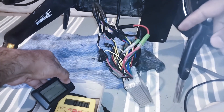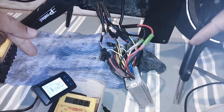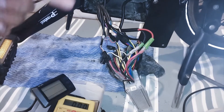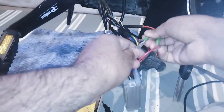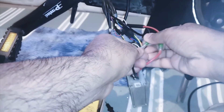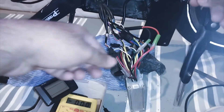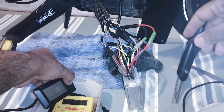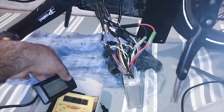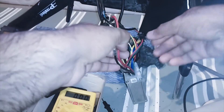Whenever you want to plug this in or plug this out, always remember to switch off the power from the battery. I've switched off the power from the battery, removed it, and put it back — you can see there was a spark. That was a mistake I made and you should not do it. Now I've switched on the battery and the display is on. These two are the power cables.